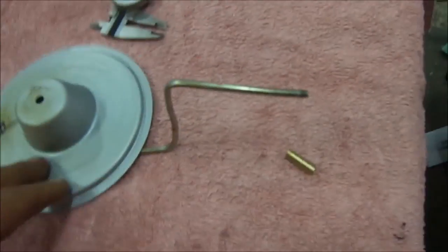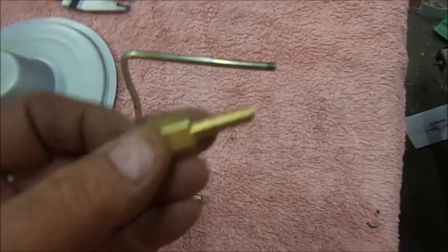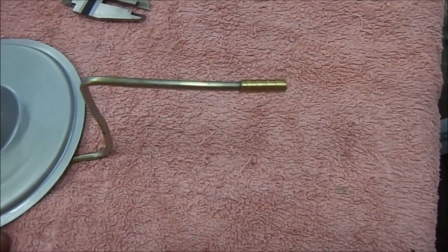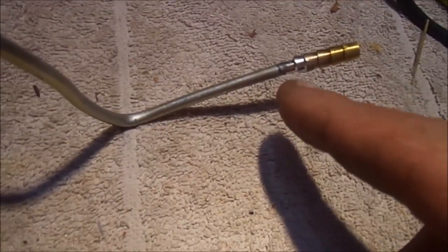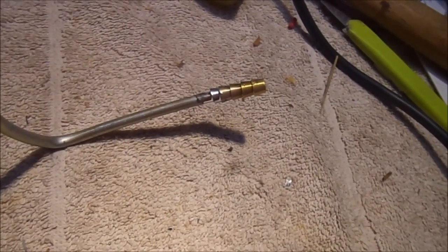Now, to transition from the brake line to the quarter-inch LP gas line, I took a barb and reamed it out, and I'm going to put it on there and solder it — it should be absolutely more than adequate. It's not pretty, but it's soldered, and this thing is about three-quarters of an inch in there. So my hose will fit right over there with a clamp, and we're almost ready to fire it up.